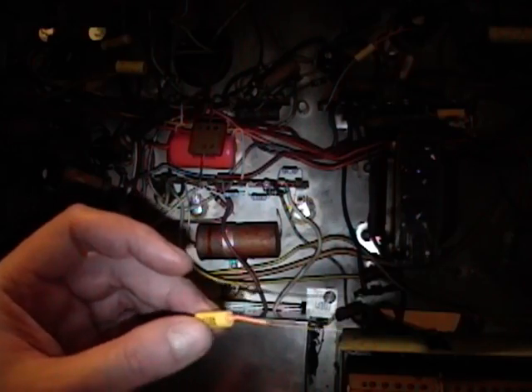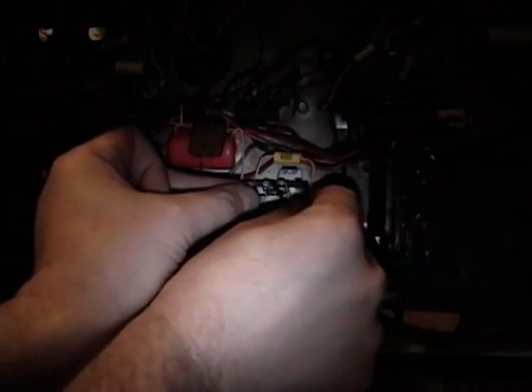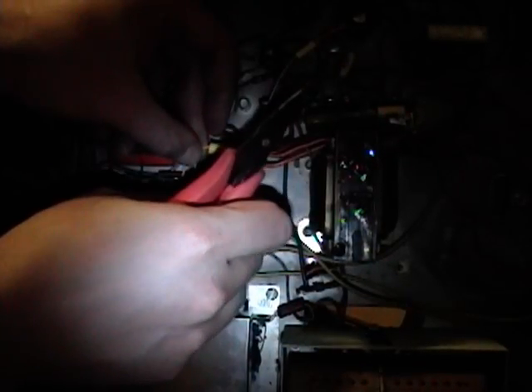The next step is to bend the leads so they fit onto the terminal — I need to go from the first to the fourth terminal, so right about like that. I bend it here and about there, then use small needle nose pliers to bend and wrap it around the terminal, squeeze it down. When you cut these leads, little bits of wire go flying — it's not a bad idea to keep track of where they land, because a clipping could fall into something else and short out when you power up the set.